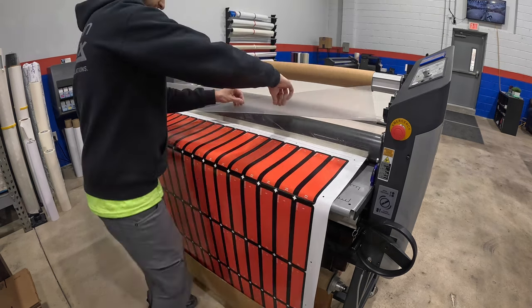I'm going to change the knife from the double edge cutter. I'm actually going to pop the single edge blade in here, because that's going to be a better cutter suitable for this. So I'm going to change the tool. I'm going to take out the double edge cutter. You just push in the button on the front here with my thumb, and then you're able to unscrew this tool. That comes out.